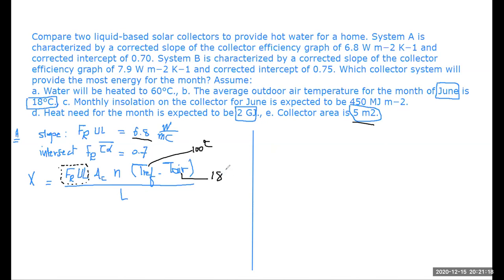Regarding this T air, if I wanted to design for my own house, can I use the current month, or do I take the average of the year? You have to do it for every month. Oh, I have to do it for every month. Remember the example I showed last time that was in Arabic? It is to be done for every month. Okay, then how can I take the final collector design? You are going at the end to come up with an F factor, F value, which says how much of the energy will be taken by the solar collector, and it will give you some sort of an average value of the energy that you are going to look for from collectors.